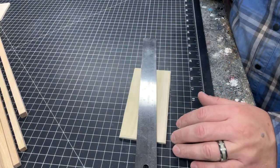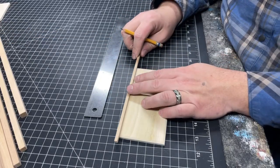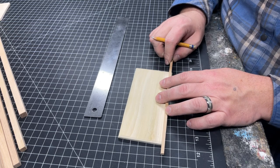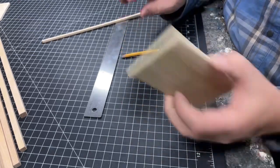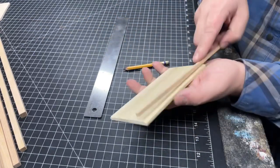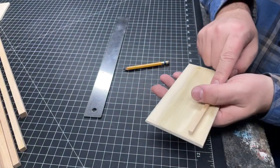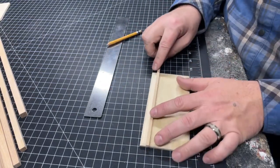So this is where we're going to have the skirt. It's going to be in from the edge a little bit, stylistically, to make it look clean. You could go all the way out to the edge if you want to, but traditionally it's inset. So you can reach under the edge of the table and grab it, and you don't bump your fingers on this hard edge. It's also stronger. It becomes a corner brace for the legs. That's why we're putting it on.